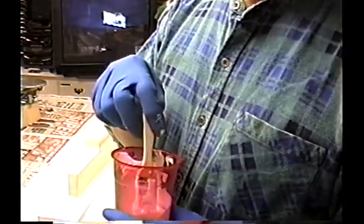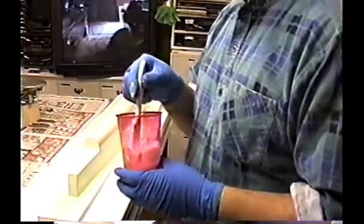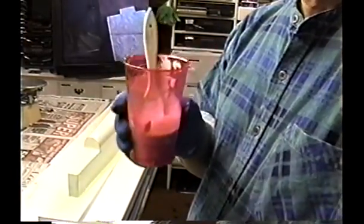Another tip that I've found, I like the white gel coat, and so does Ed Gallagher. We've both used gallons of that black gel coat that George sells, and even George admitted it was not his first choice with the molding projects he's working on. So if you get nothing else out of this video, if you're going to do a little hard mold and you're going to order from Aerospace Composites, order the white gel coat. Much easier to use, much friendlier.